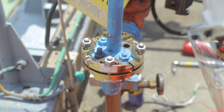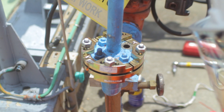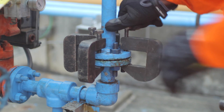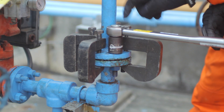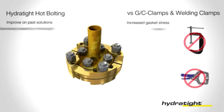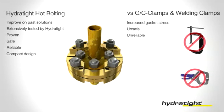Additionally, the MoreSafe bolt renewal clamp can be left on the flange temporarily and hence can be used to reinforce the flange in case bolt renewal is not possible. In the past, hot bolting was performed using the G-clamp principle. This features an unstable design, constricts movement, hinders the use of nut splitters, increases load onto gaskets increasing the chances of a leak, is unable to be utilised in tight spaces thus limiting its scope, and critically it's not safe.